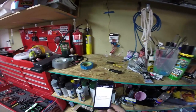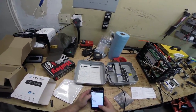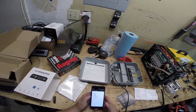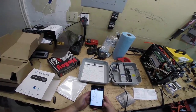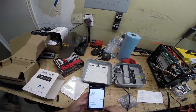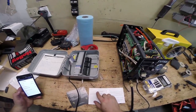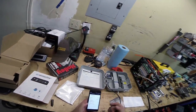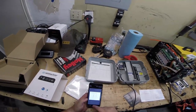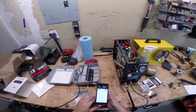You can see there's a 'U' indicator up there while the firmware is updating — just let it run. Now we can create a new program. The update's done so we're gonna title the program 'General,' enable weather data — which is the cool thing because it's gonna check the forecast — and set it to water every three days with a start time around 4 a.m. here in Texas before the sun comes out. There's also a cycle-and-soak option which splits the base watering duration into multiple cycles, but I don't need that since all my zones are separate.